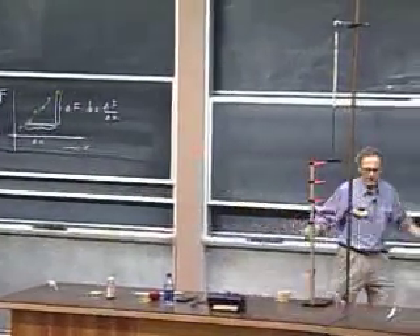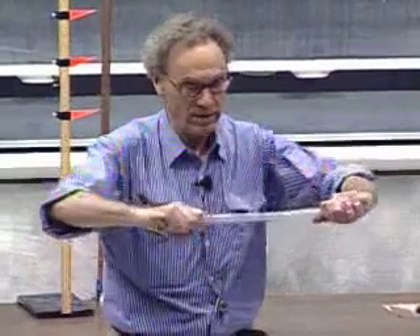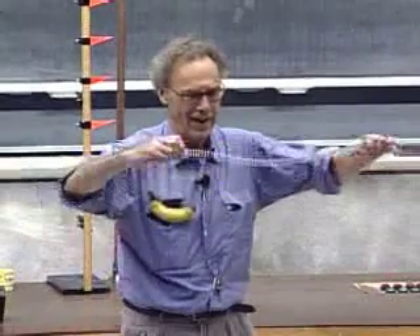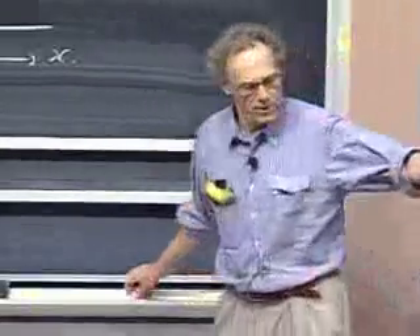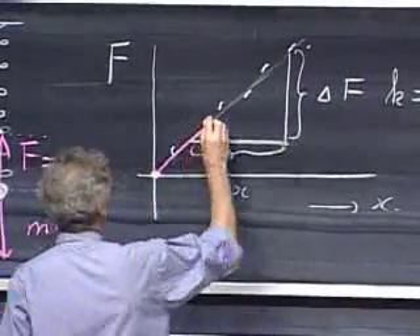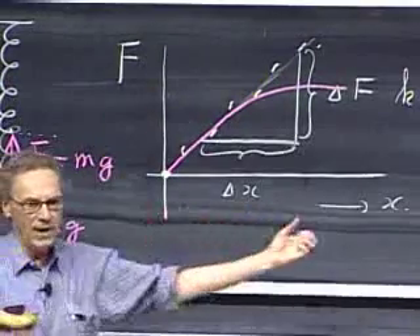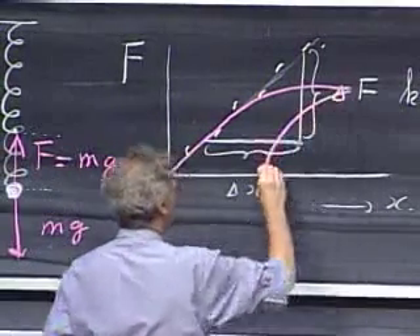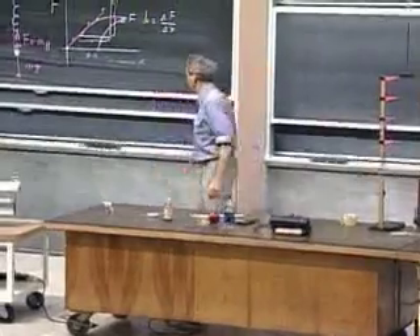I can, of course, overdo things. I can take a spring and stretch it to the point that it no longer behaves like Hooke's Law — I can damage it, I can do permanent deformation. Hooke's Law is no longer acting. Look how much longer this spring is than it was before. There comes a limit how far you can go before you permanently deform the spring. After overextension, the spring was longer at the end than at the beginning — a net extension which will always be there. Hooke's Law holds only within certain limitations.